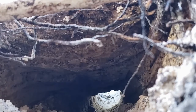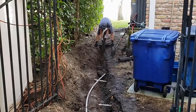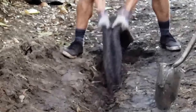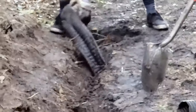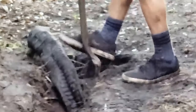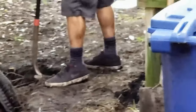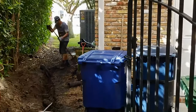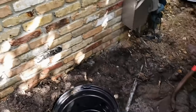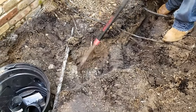We're going to go on the other side and clean that out — you can see there's a nice tunnel through there. Sometimes you'll find an old drain line in your way — you can see it's already collapsed, all smooshed. You can just get it out of the way: cut it with a shovel or pull it out, whatever you need to do. We're actually going to take these downspouts — there's two of them, one here and one right here by the pit — and bring those into our basin.